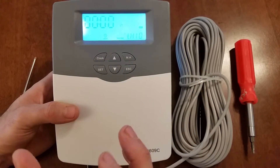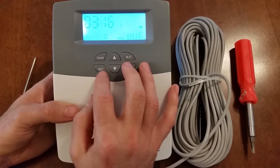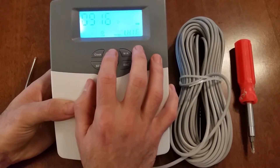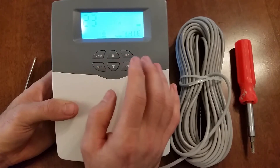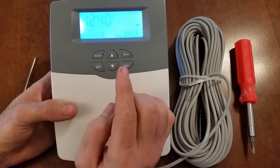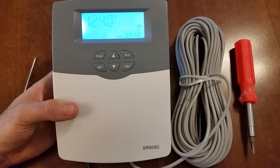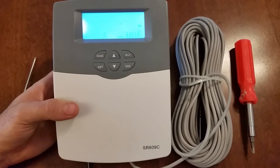That's TH1 start — that's when the electric element comes on. Then we set TH1F, which is when the electric heater goes off. We would take this up to 23, and in military time you'd set it to 2359 — so we'll leave it at 2316 for the video's sake. And then the kickoff temperature — being set at 124, it says: if the temperature falls to 110, kick on the electric element until the water temperature gets up to 124, and then turn it off again. That's a good setting for a lot of people.